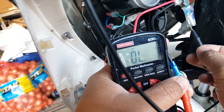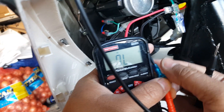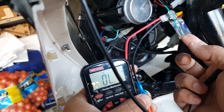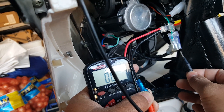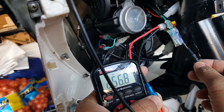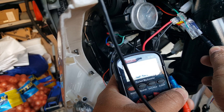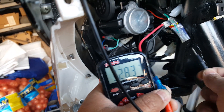You hear that sound? There we go. Now if I move this and touch the black wire here — which is our positive wire on our harness — it shouldn't make a sound, because that would mean we didn't do the connection properly. I don't hear anything. You see some resistance but you don't hear anything, which is fine. That means there's no continuity there. Excellent — so now we're going to swap it, and also make sure we have a good connection to our positive wire, which is our black wire in the harness, and our red wire here. Red should always be positive.